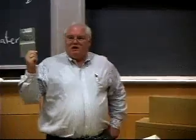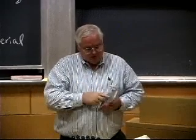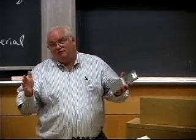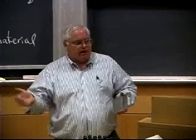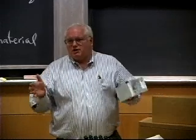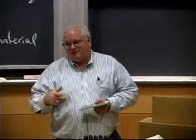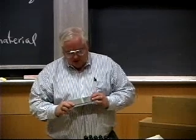This is something called friction stir welding. It's the only truly new welding process. When I say truly new, it's fairly new, in the last 10 years. The American Welding Society lists 199 different welding and cutting processes in the back of the handbook. I counted, and in the first half, from 1880 to 1950, 75% of those processes were developed in those 70 years. In the last 50 years, only about 25% have been developed. In the last 10 years, this is about the only process I can think of that's new. We're kind of running out of ideas of ways to join things.